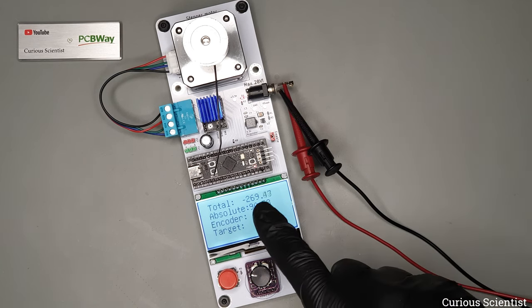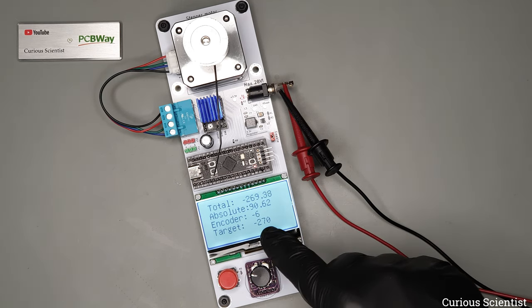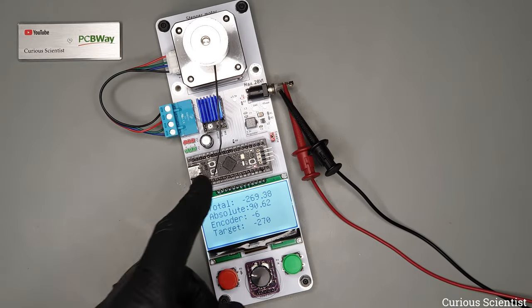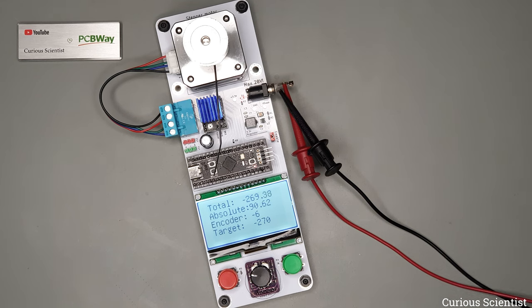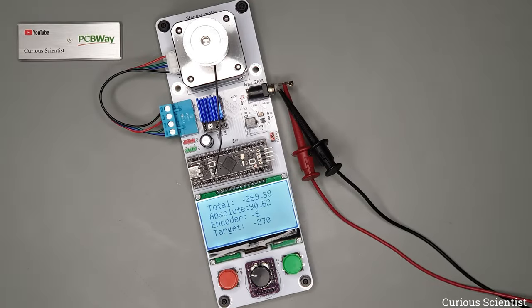And since the microcontroller also sends this total distance value and the target value to the serial port, I will show you how this behaves when you set the target value, and how you can plot these numbers, because it's very interesting when you use the serial plotter and you plot these values, and the motor is approaching the target value. Since you have the encoder on the backside of the motor, you can constantly monitor its position, and then it looks very nice, as you have an almost exponential curve of the position going towards the target position. So let's go to the computer, and let's see how the code is built